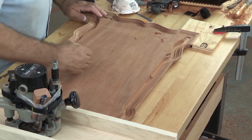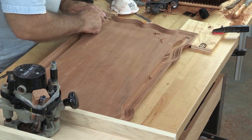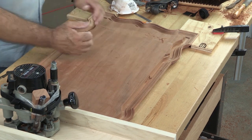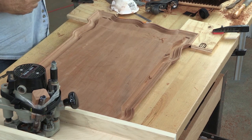If the wood catches the bit or something causes it to jump, the bit can jump right into the molding. Whereas if I just leave a little rim — my sled is going to keep it all flat — I'm taking that wood away from the other side at the last, so if it jumps, it jumps back into the middle again.